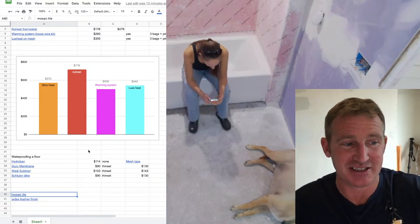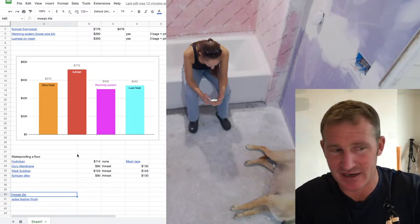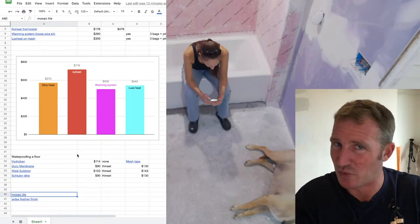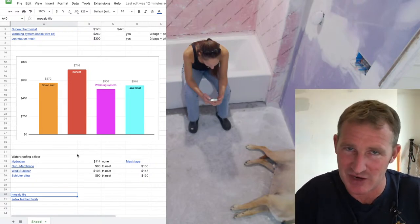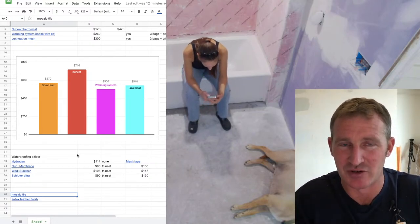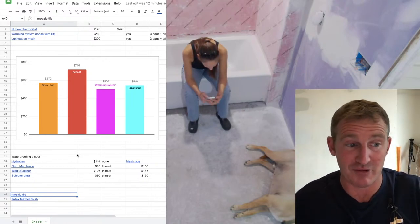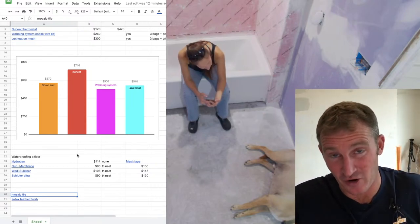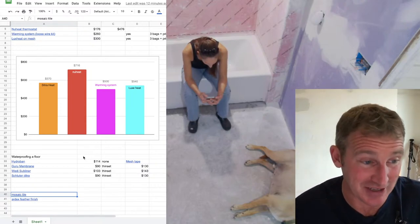So all I'm saying is that with the subliner, where everything laps a little bit, that could be an area that is going to be a little problematic with setting that tile. With little 1x1 tiles, you're combing your thin set in a direction and trying to collapse the ridges, so it's going to be really tight to the floor. If anything has a little bit of a ridge, like those overlaps, it's going to be a problem. Same with the Ditra. If you want to make that 100% waterproof, you need to put the Kerdi-Band over the seams, and that can raise that area. So that's another issue with it.